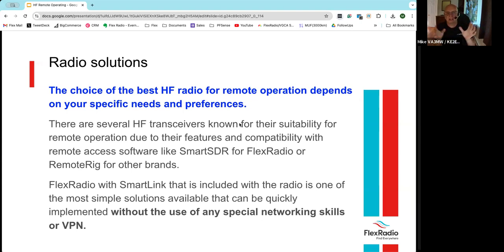We really don't care what they are. And the client end, the part we're sitting at, goes, great, thanks very much, hangs up there, now calls the radio directly on a peer-to-peer connection. So you don't need static IP addresses. You can have what we call DHCP addresses. It actually works on Starlink for commercial accounts where they give you a proper IP address.